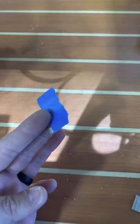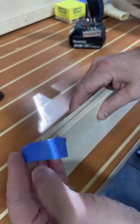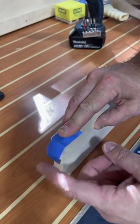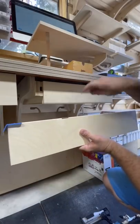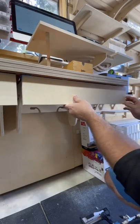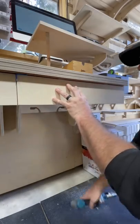That's what we need. I know it's crazy, but watch. This is our simple drawer face. We're going to take this piece, stick it just like so, and then have the little pieces of brads just hang in there. For this application, I'm going to be using pin nails to attach it to the drawer base. So you basically put your brad nails in place, put them up to where you want them spaced. And here's the magic of the blue tape — now you've got that space in between the two drawers and the top. Then you're good to go.